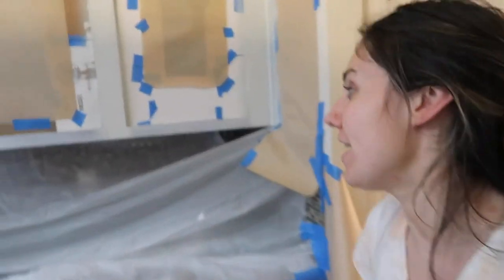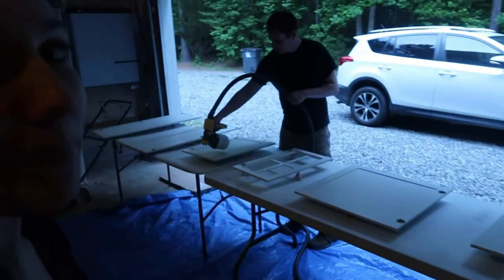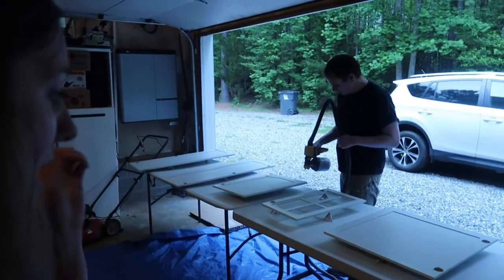As soon as I got off work I sanded down the primed frames, vacuumed them, and wiped them down with a tack cloth. Then I took a two inch tapered brush and did all of the edges on the insides of the frames. Now Noel has his Wagner sprayer and he's going through and putting the first coat of spray on. We are on day five of the project — Noel is painting the second coat on the back side of the doors and drawers. We're expecting rain which is why we're doing it in the garage under cover.